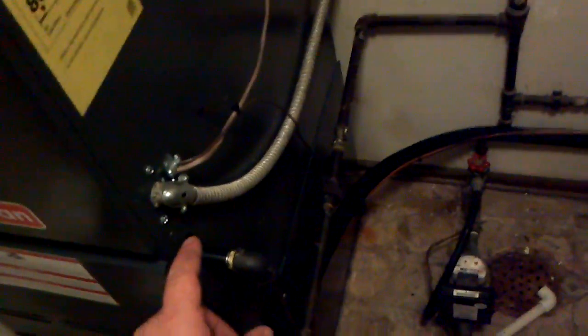We're going to extend it for the thermostat wire. This is old thermostat wire — there's nothing wrong with it, but I put in a new digital thermostat. I also ran a new thermostat wire from here to outside since it was getting kind of old, the insulation was crumbly, and somebody hit it with a weed whacker. Just went ahead and ran 20 feet of two-conductor wire — inexpensive insurance.